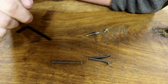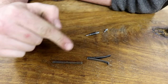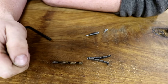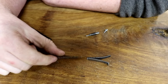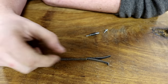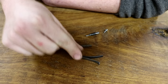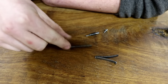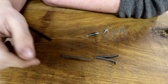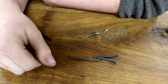A coil spring is cheap to manufacture, cheap to fit, easy to reproduce in the same power and size. A mainspring depending on the gun — a Beretta unit is quite expensive, but the actual spring itself might be 10 to 15 pounds, whereas a V-spring can be anywhere up to 200 pounds. So I would always use snap caps for a V-spring gun, but I wouldn't call it utterly necessary for a coil spring gun — I'd be happy to change those mainsprings every couple of years anyway.